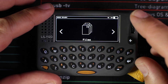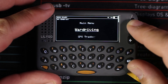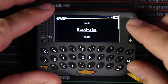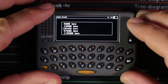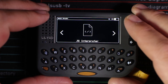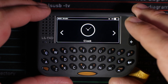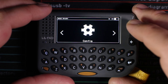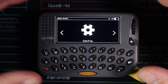The file server works beautifully, and GPS and war driving works phenomenally. One thing to note: when war driving, make sure your baud rate is set to 38,400 BPS, otherwise it will not pick up satellites. The JavaScript interpreter works really well, the clock works, connect settings work wonderfully, and the config file works the same as always. Overall, Bruce works really well on this device.